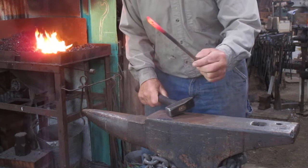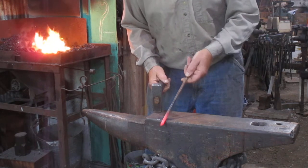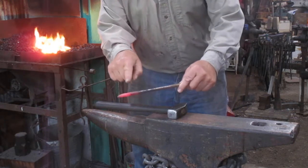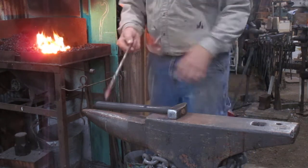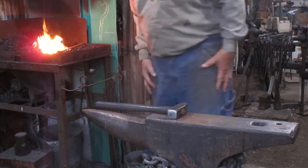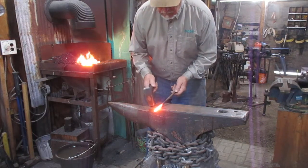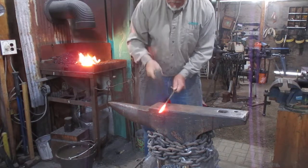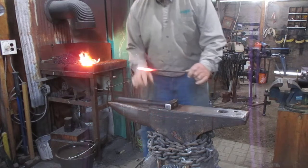You can see that there's now a taper in here. The next thing I'll do is come down a certain distance, raise the piece up on the anvil and strike it — that's going to put a fuller mark or a dent in the material. That's the area that's going to be isolated for the leaf; below that will be what I draw for the stem. Now I've lost my heat, so I'm going to go back into the forge. Our metal is once again hot and I'll now develop this fuller area to make it a bit deeper and more obvious. You'll see that doing this I'm actually making a lump of material isolated over the edge of my anvil — this mass is now pulled away from the bar and I'll use that to form the leaf.